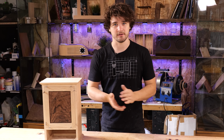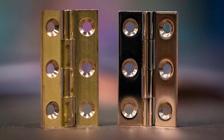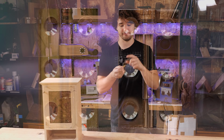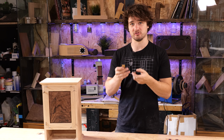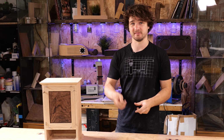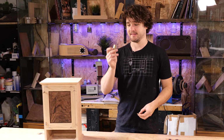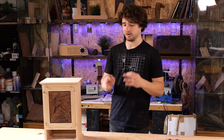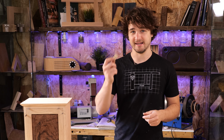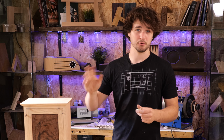Okay, so at the end of the last video, I gave you a little call to action to watch my video on how to tune hinges. That includes filing the edges, squaring the ends, cleaning up the faces, and just making sure they work exactly as intended. Because if you buy these things as standard from just a DIY supplier, they're not going to be easy to install and you're not going to be able to get that consistent shadow gap and a whole manner of other problems. However, with just a little bit of TLC, these will work exactly the same as those high-end Brusso hinges.